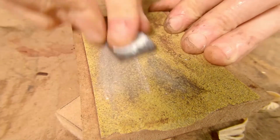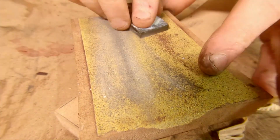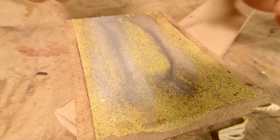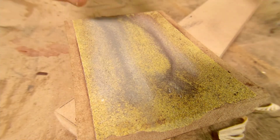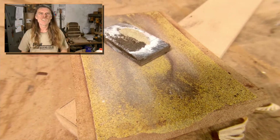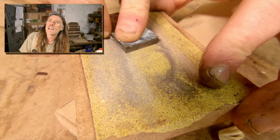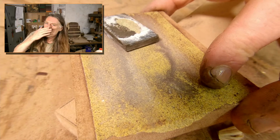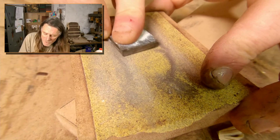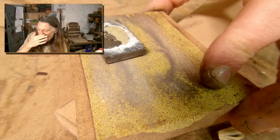Okay, so right, does a damp rag spread the glue over more of the wood, or would it be better if left to dry then chiselled off? That's TV1. Yeah, I mean, with an acoustic guitar, the last thing you want to do is spread glue all over the place. With an electric guitar, you could just sand it off and not worry about it. But with an acoustic, you don't want to be doing any more sanding than absolutely necessary because the plates are all specific thicknesses. So with an acoustic guitar, we get extra careful about exactly the amount of glue we put on.